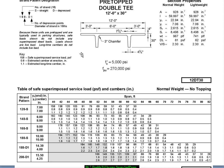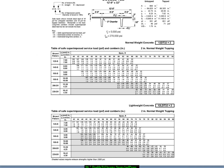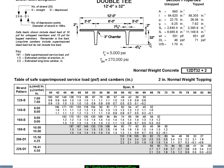To explore options for avoiding the depressed strand, we can go to the so-called 32-inch deep double T — 4 inches more than the 28-inch version but otherwise identical. Looking down at 60 feet in that table, we can get 82 pounds per square foot with a 188S designation — S meaning straight, no depression, 18 strands of half-inch cable. So in order to avoid the depression and still achieve 80 psf of superimposable load, we're going to go with the 32-inch deep double T.